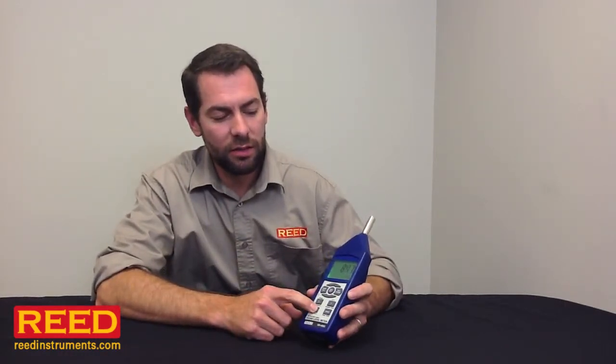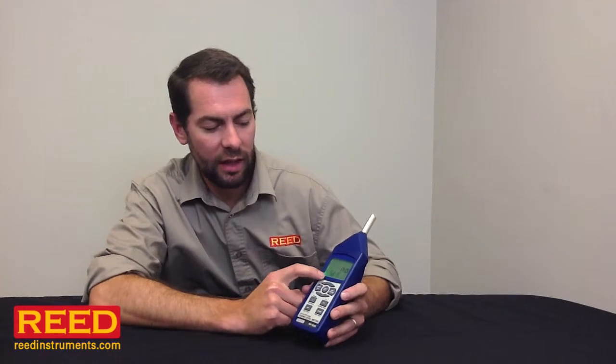The first one — for whatever reason, you want to make sure the SD card is in the unit before you turn it on. I'll turn the unit on. I've already set everything up, but I might not have formatted the card, even if I thought I really did. So let's go back to our menu and make sure. I'm going to hit the Set button, hold that down until we get into the menu. We're going to scroll through until we find the SDF — it's on No. We're going to select it to put it to Yes, hit Enter. You have to hit Enter a second time until you see it start flashing, and then it will move on. The reason we do that is because when you format the card, any data that's on it is going to be lost, so it's kind of giving you a second chance to make sure that you really do want to format that card.